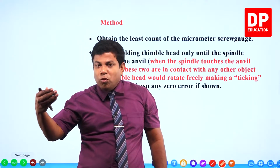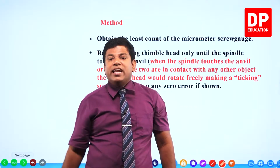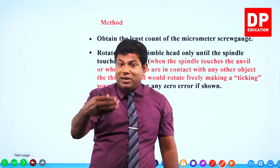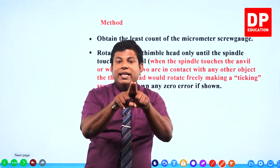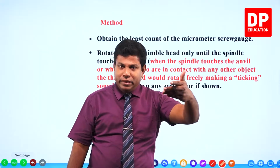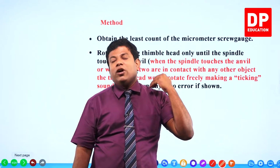If the vernier has moved more inwards, you call it a negative 0 error. If the vernier has yet more to move but still the jaws are already aligned, then you call it positive 0 error. I have done this already. A similar issue could be here also.